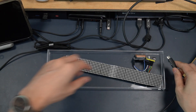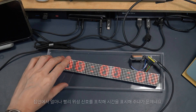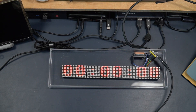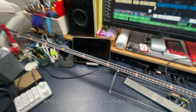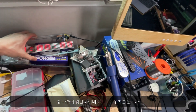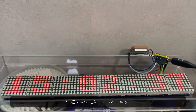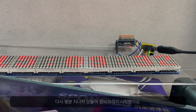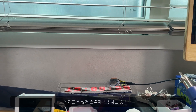Let's see it in action. After first plug-in, it displays all zeros. My big question was how well and how fast it can receive satellite signals and lock the time from inside the room. At about a meter away from the window, it wasn't able to lock any signal at all. But when I relocated closer — within a few centimeters of a window — the display started to show the time in just about a couple of minutes, and the module started to blink a few minutes later, meaning it had locked and was outputting position as well.